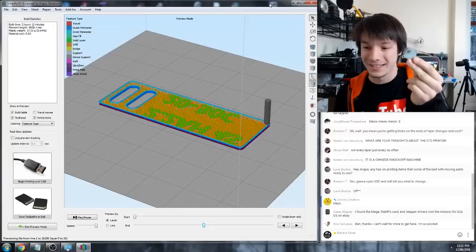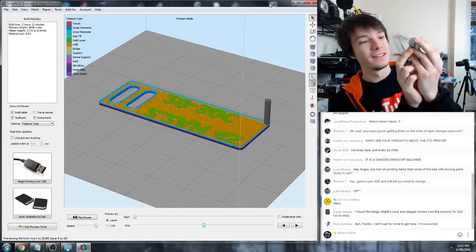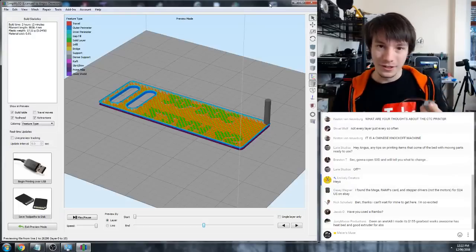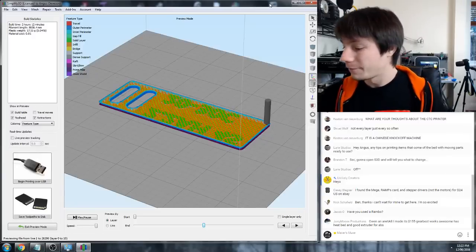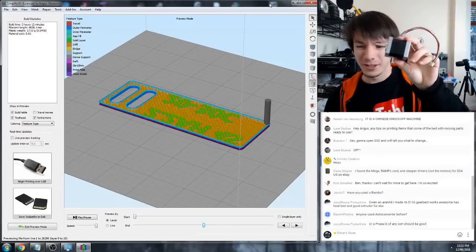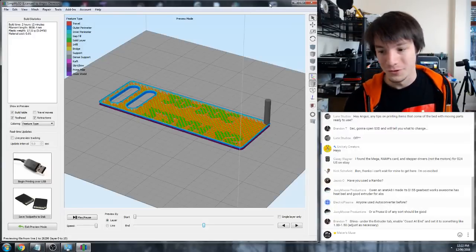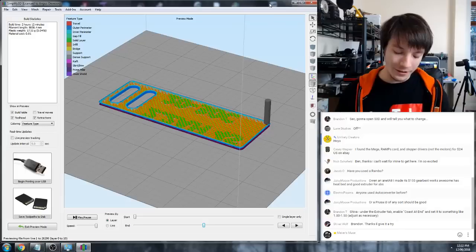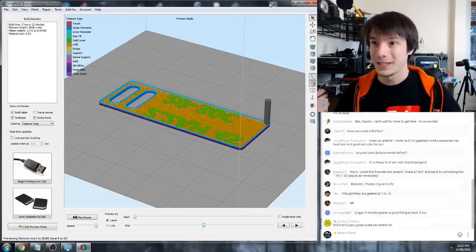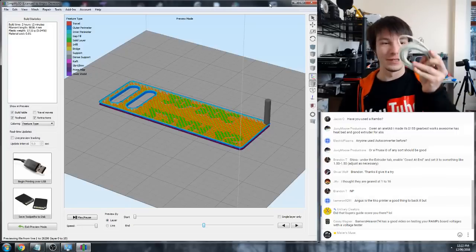For the 404 Villain, because it's an extremely low cost machine, I've gone with the lowest cost components. These are the really low cost geared stepper motors that the 101 Hero on Kickstarter is actually using - the 28BYJ-48 5V DC stepper motors. They're geared at a really weird ratio like 1 to 63. They will work for a low cost printer, but for the extruder because I think they're too gutless, I'm going with a proper NEMA 17 - these are about $20 each.